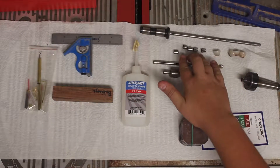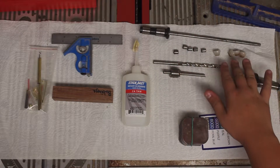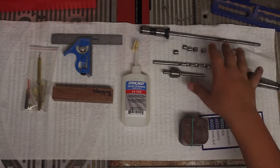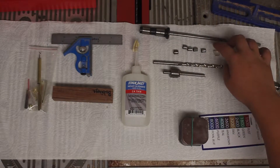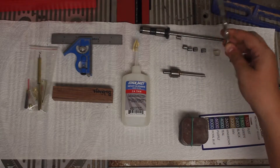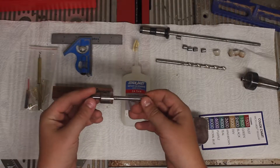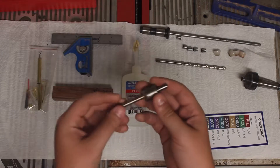These five bushings come with the mandrel and these are CA non-stick bushings — they're made of plastic. These are for applying the CA finish. All the stuff right here comes in a set except for the plastic bushings. Then you need a drill bit that fits the pen set. What this does is it clears out any glue inside of the pen once you drill the hole and put the brass in, and it also clears out any extra wood.